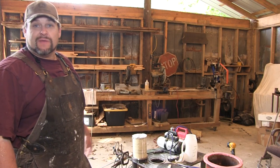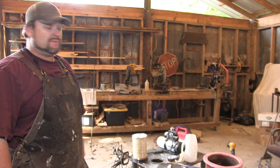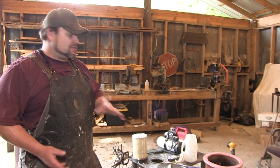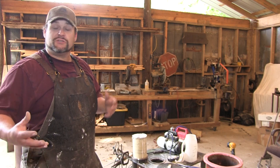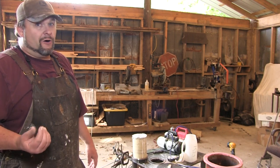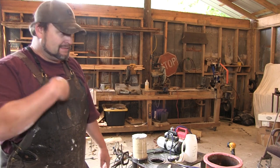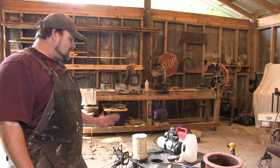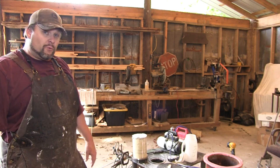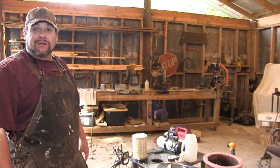Our flask has now been poured up, and we came real close to screwing up right there simply because it took so long to vacuum. Normally when I pour these up, I'm actually pouring a double stack so there's less volume. But it took so long to get the plaster to vacuum and roll over that by the time I came out to add the last bit to the top, it was already starting to thicken up and I actually had to apply it with my hand. Hopefully it's not going to blow out the bottom. This is one of the aggravations when dealing with equipment that isn't set exactly to what you need, but it looks pretty good for the situation.